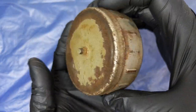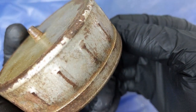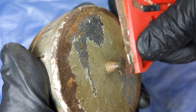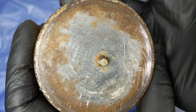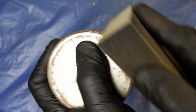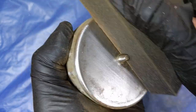Now for the tape wheel. It seems I was lucky to find this part still with the dispenser as they can go missing. It's in great shape too, so I'll scrape off most of the old paint, give it a quick sand, and then a bit of fresh paint to cover everything up. I'm not too worried about leaving a bit of the old paint there as long as it's even. It's important to still sand these surfaces even just a little bit — it roughens up the surface and gives it a key for the paint. A key just means that it's got something for the paint to grip onto as it dries, as opposed to a smooth surface where it can just peel off easily.